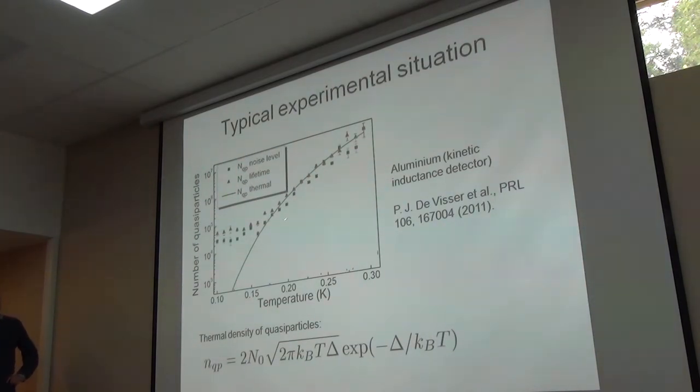So the density would drop, but in most of the experiments, or say in all experiments, what happens is that at temperatures around one tenth of the TC, the quasi particle population saturates. This is data from an experiment in Delft a few years ago, where they used an aluminum based kinetic inductance detector, and the quasi particle density saturated at about 150 millikelvin temperature, which is still on the level that you have tens of thousands of quasi particles in a kinetic inductance detector,